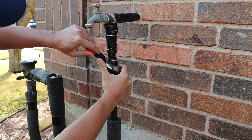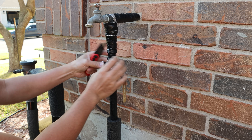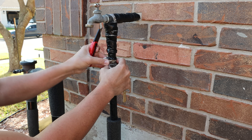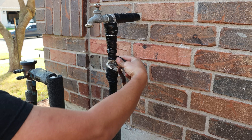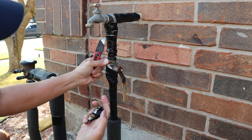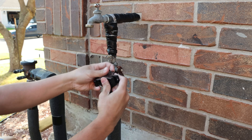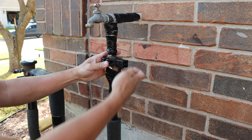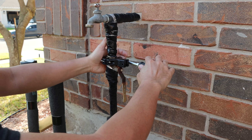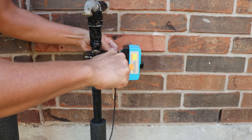Time to install the valve controller. Don't mind my Life Hackster rigged pipe insulation — this was from the Texas freeze last year and it still works. Also, as you can see on the handle, everything outside gets rusted, but luckily the screws on the YoLink are all stainless steel. To install the bracket, remove the insulation on the valve collar — that's where you'll place it. The motor has some torque, so don't put the bracket directly on the pipe. Remove the machine screws from the bracket, place it around the valve collar, and tighten the screws evenly so it's not lopsided.